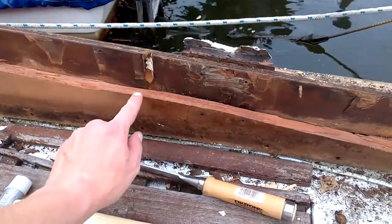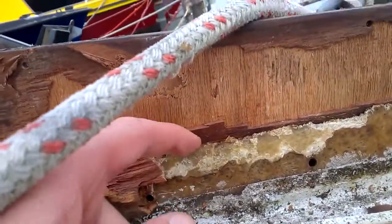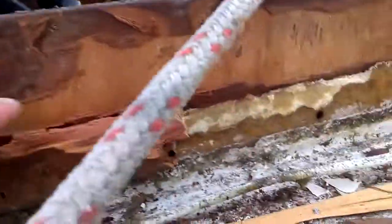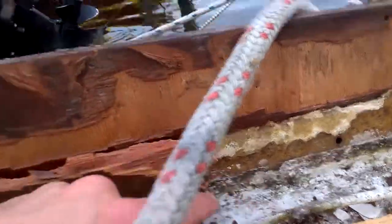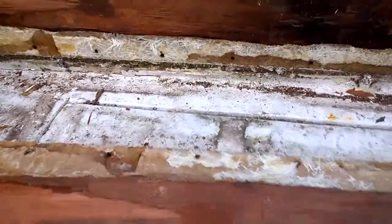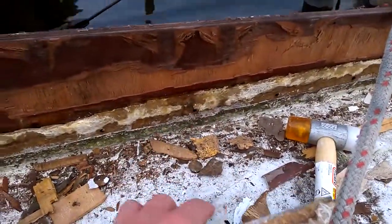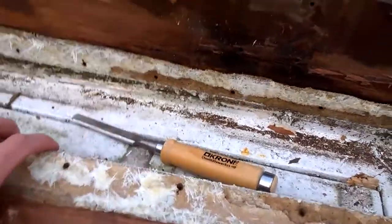I marveled why it is so hard to remove this piece — this is actually hardwood, this is plywood. And here's the answer: hardwood is glued to a layer of glass fiber, and this glue connection is quite solid, so it won't come off that easy. I decided to make an incision here to remove the glass fiber with the hardwood. It was too tedious to make incisions just with a small biter, so I decided to drive it like a wedge between the hardwood and the fiberglass, and then slowly pull it from the fiberglass. And apparently it worked quite well.